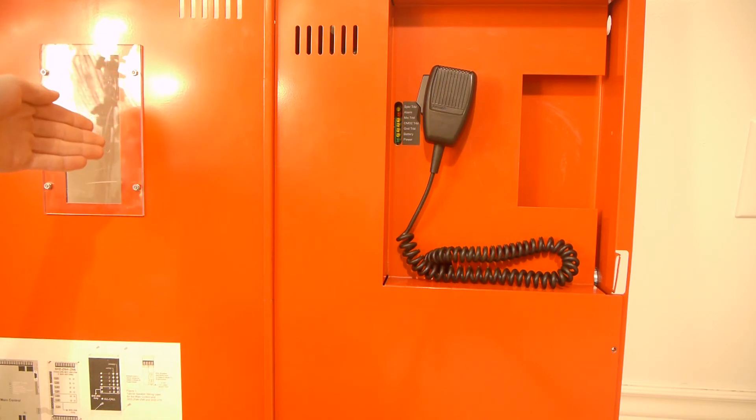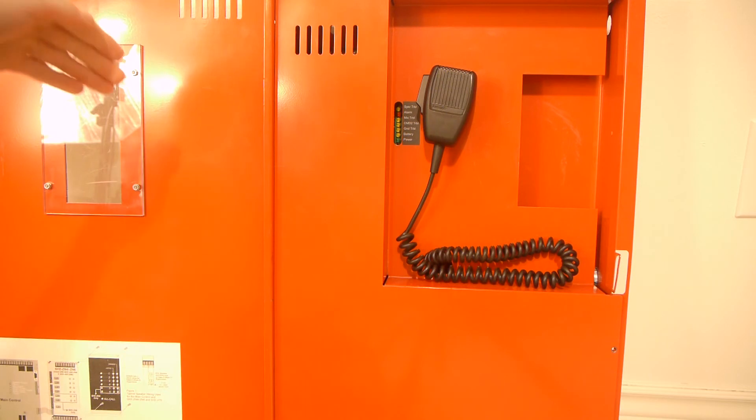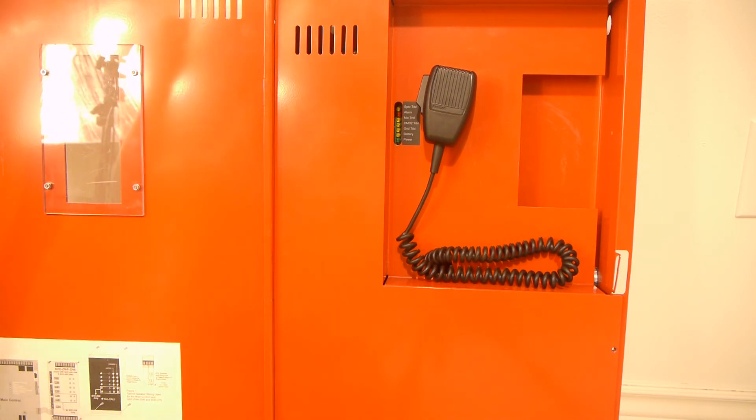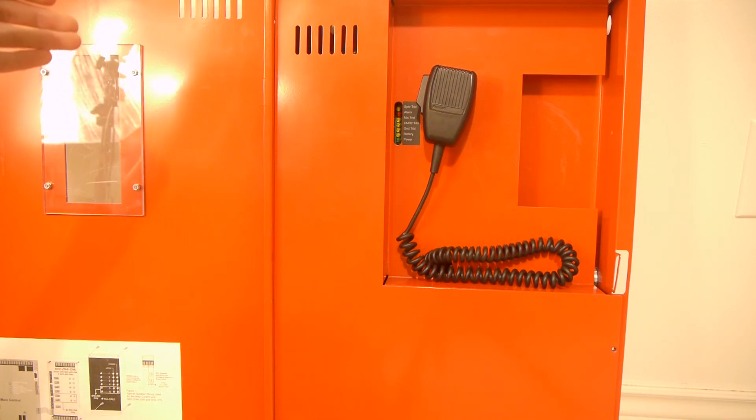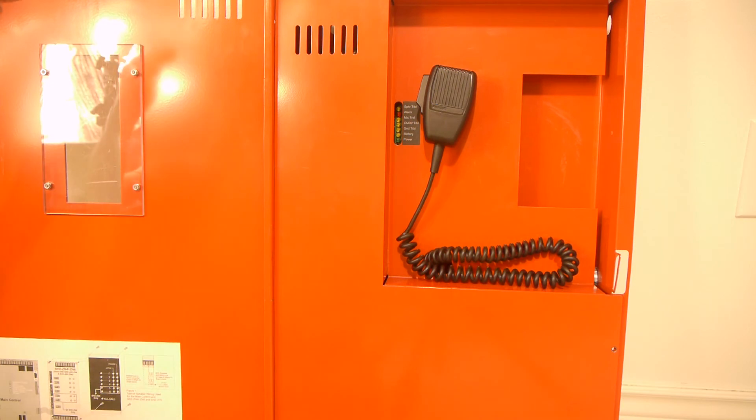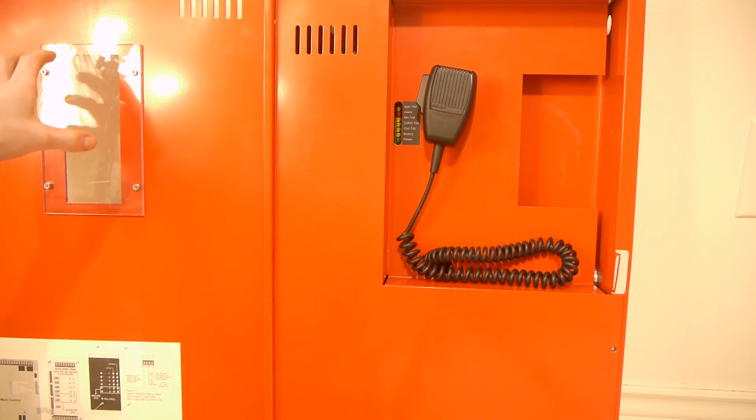So should you buy one of these panels? First, these are non-proprietary panels, so you can get documentation and software for free — I will link that in the description. There is also a very good deal on eBay right now for one of these panels, so I'll link that too — I'm not selling it, so do your research on the seller, but it is a very good deal. How do you control this thing? It's actually very simple: there are two inputs labeled command and command 2, which just get hooked up to a relay or a NAC on your fire alarm control panel, so this will work with any fire alarm panel with a NAC circuit. This panel outputs 25 volts at 50 watts, which is probably enough for any enthusiast. I don't recommend this as a very first fire alarm panel, but I do recommend it as a first voice evacuation panel. Technically it could be used as a main fire alarm panel, but it is highly recommended to use it with one. If you're looking for a voice evacuation panel, this is a very good choice for a non-integrated panel.